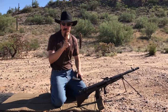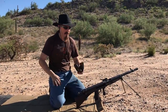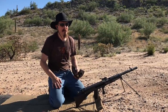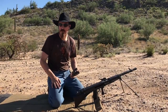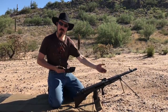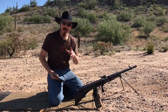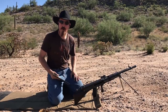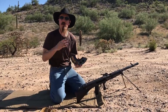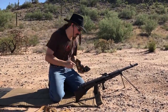So I took the performance you just saw — it is now like a week or two later — and talked to some folks who are knowledgeable on the Chauchat. They said that problem sounds like a bad extractor. The extractor was losing its grip on the cartridge a little too early in the cycle, which led to cartridges getting stuck in the ejection port. Fortunately I happen to have some spare parts, and I have a second extractor. I didn't notice anything actually wrong with the first one, but I swapped them out. Let's see how it does with a different extractor in.